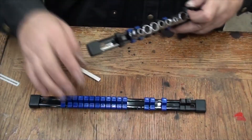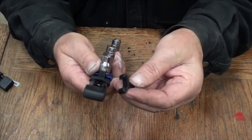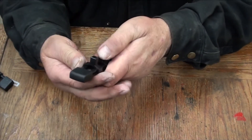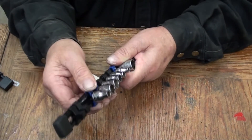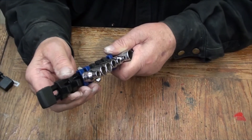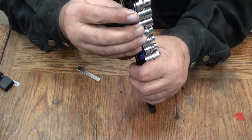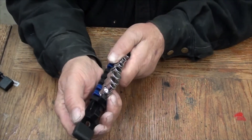I ground them back a little bit right here and right here — maybe a thirty-second of an inch off each side. On the inside there was a tiny little ridge, so I just took a half-round file and gave it a little touch on both sides. When you put these things on and clip them in so they lock in properly, they are there to stay. They do not want to move — just enough resistance — whereas the original clips that come with the rails are a little on the loose side. These ones are very well locked in, going right into the root of the rail.